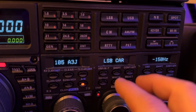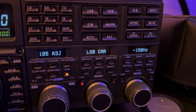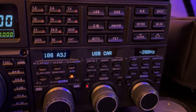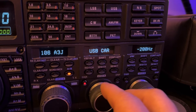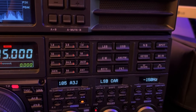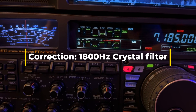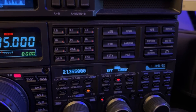Since I'm going to use that 1800 a lot, I went into menu 105 and adjusted the LSB carrier insertion point down to minus 150. What that does is decide where zero shift is — I want zero shift to favor lower frequency response. On the USB I did negative 200, it just sounded better. I'm basically deciding where the center of shift is, giving it a little more low end when I'm using that 1800 Hz crystal filter. If it sounds too dark when I go back to the 3K filter, I can shift positive to compensate.